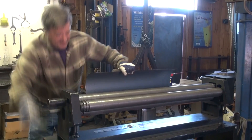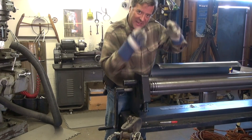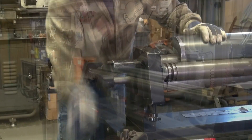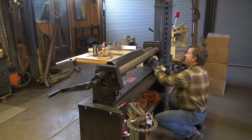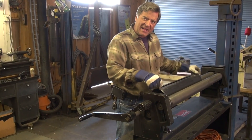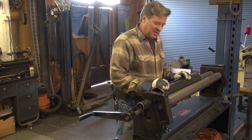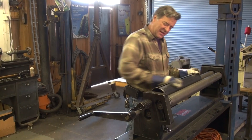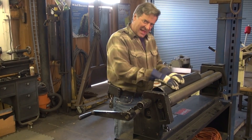You're going to be here a while, aren't you? Yeah, this is the old-fashioned way to do it. Instead of going ten turns, I'll only do five now because it's starting to get a little tight. Now we're starting to get somewhere — the gap's starting to close up. That'll come out just about right. Just clamp the edges, tack it on each end, work your way through tacking it, then come back and weld it all. TIG or MIG? This will all be TIG — nice and easy, controllable, not a big glob on the inside, and you don't want to blow all the way through. After you get it welded, grind it down just a little, smooth it off, then bring it back over and roll it some more to even everything out and hide that weld in there the best I can.